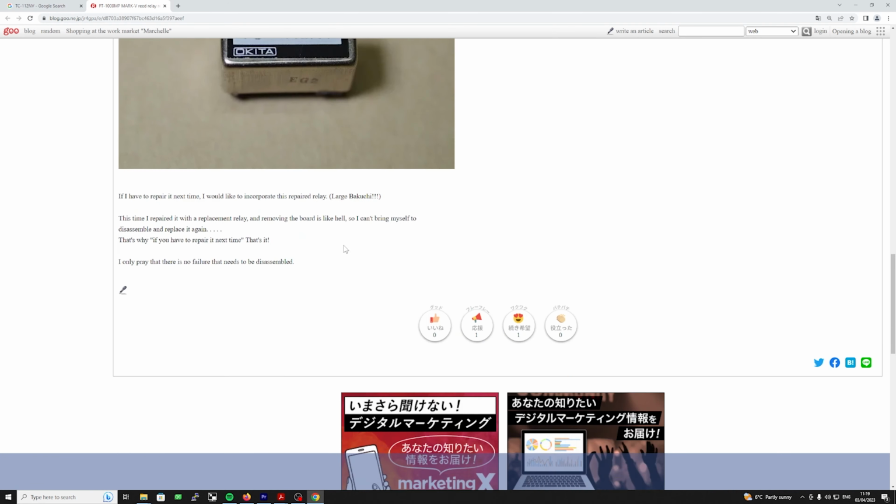So this is what I've put in there. I've got these from Farnell. I imagine you can buy them from DigiKey, Mouser. And it's a MDSR-7, made by a company called Littelfuse. These are 200 volt DC rated at 10 watts. That's what they're saying.